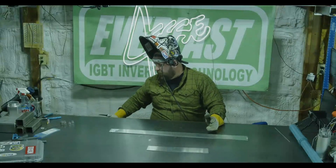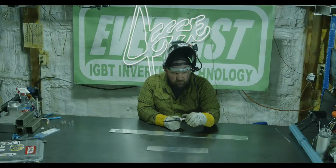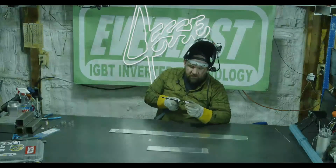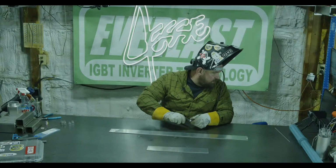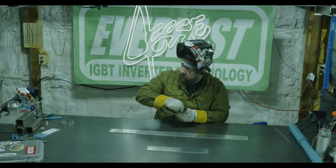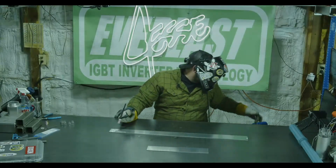So I normally weld with 1/8 inch. Let's go ahead. We can jump up to a 6 real quick. It's a nice simple swap. We're going to leave our gas flow high. Suck this tungsten back in. So here we go. Let's get on this number 6 cup. So again, we're running 25 CFH on a 6 standard.